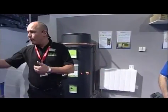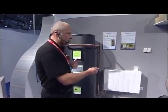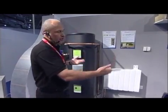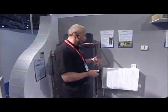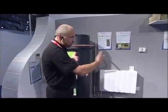As we reduce flow temperatures within the heat pump system, its efficiency increases. For every one kilowatt of electrical energy you'll get more heating energy into the system. If we were to run a standard radiator at 35 degrees Celsius, it becomes more like a wall space heater - it can be up to 6.8 times its physical capacity to meet the heat loss from that room. By introducing other types of heating systems, the physical dimensions and size of those units come down.